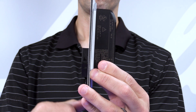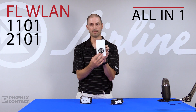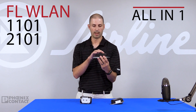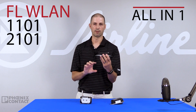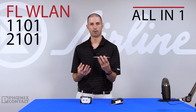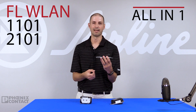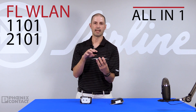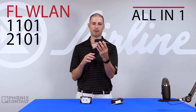On the inside of this nut, you have your power and data. This keeps it outside your control cabinet. If you're tight on space for DIN rails, you don't have to have any space in your DIN rail — it mounts on the top and also reduces the amount of punches you have in your control cabinet. With any wireless device you need to bring antennas outside the control cabinet to get line of sight. This device has the antennas and the radio built in, so it's one punch for everything.